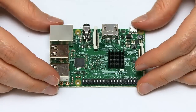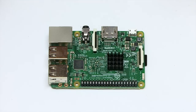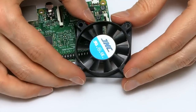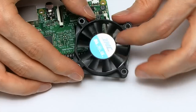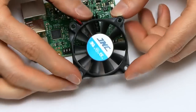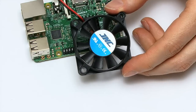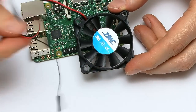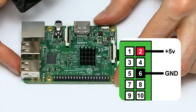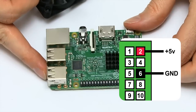Having proved it's possible to cool down our Pi quite well using a relatively small fan, I want to attach a fan to the Pi and have it self-powered. The fan I'm going to use is this small fan from a company called JNC. I think it's a 40mm fan and I know it can run from 5 volts. I've attached connectors to the wiring so I can attach it to GPIO pins on the Pi — specifically pins 2 and 6, which are 5 volts and one of the ground rails.